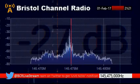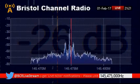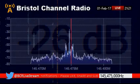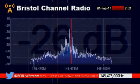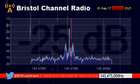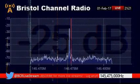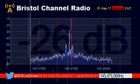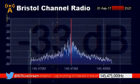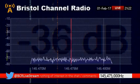What I was getting is interference on the television, and it was the new mast down there, and it's only about half a mile away from me, as you know the location, and I had to put this very tight filter in, and he also tweaked up the gain of a preamp in the splitter, cut the gain down a little bit on that because it was a little bit too much. That's made a hell of a difference, and it was all free, Dave. Well, they got to, because what they're doing is illegal. They're splattering. They're causing interference on other frequencies that they don't operate on.